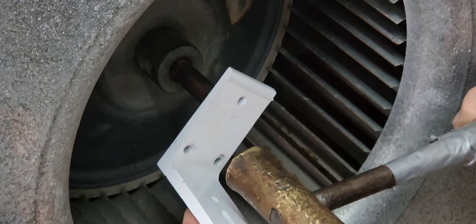Now that we've got the motor remounted securely in the bracket, put the fan housing with the fan nut-side up, and then drop the fan shaft down into this. Note the location of your cable harness — this has to line up with your cable harness on the top. Just drop it right in; don't worry about the fan hitting the housing for now, we'll adjust that later. Just get it all centered, then re-secure the bolts.